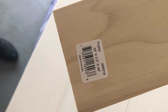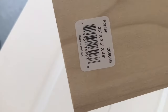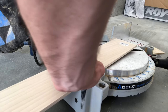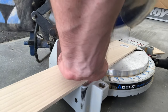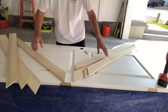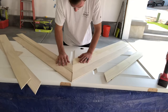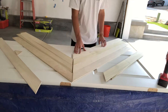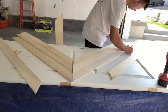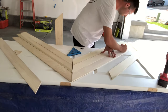For this project I used poplar wood. It is a little more expensive, so there are some cheaper options out there — this is just what I chose to use. Set your miter saw to 45 degrees and start making some cuts. You're going to want to make enough cuts to be able to lay out a rough idea of what you want your design to look like. From there, go through and mark the other side of the boards to see where you need to make another rough cut.